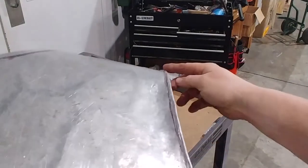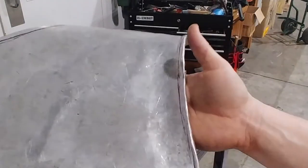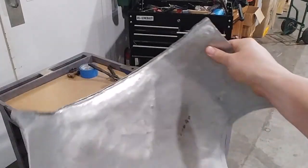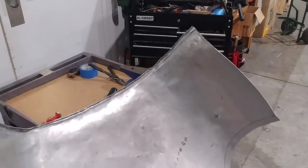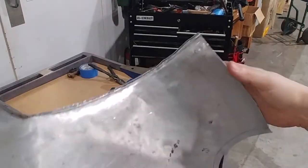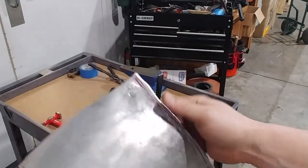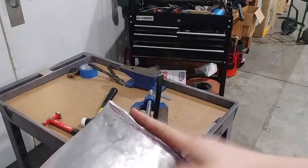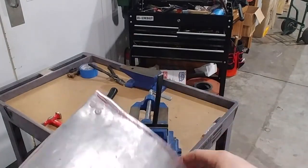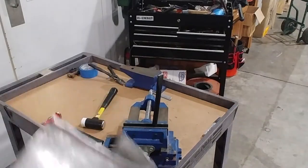Then, of course, as you start to see places that are uneven, you can just hammer those a little bit more, try to get them to roll a little tighter. Hopefully rolling everything tight. If you made a good line and you've hammered an initial good line, it'll all fall into place and need very little correcting. But correction is necessary sometimes, and we can do that. So I'm just going to beat on this a little while, freehand, loose, and try to get it to roll up on itself before we put it back on the anvil on an angle and really seal it in.